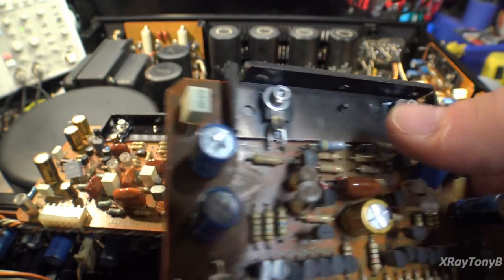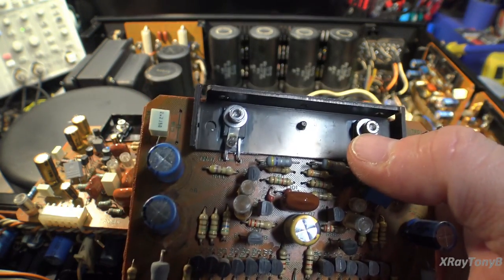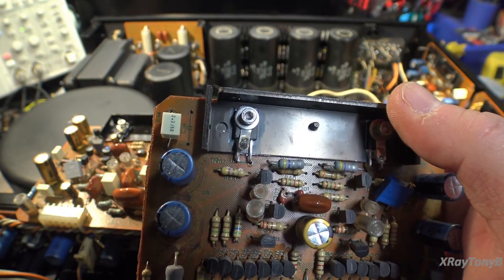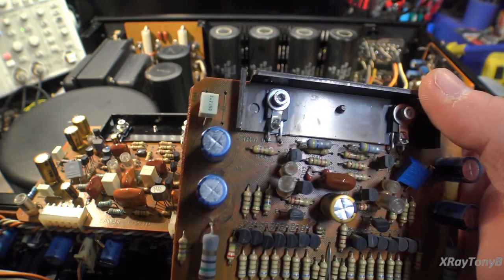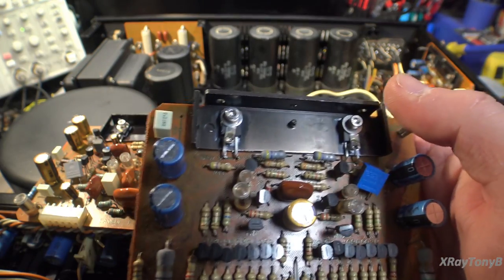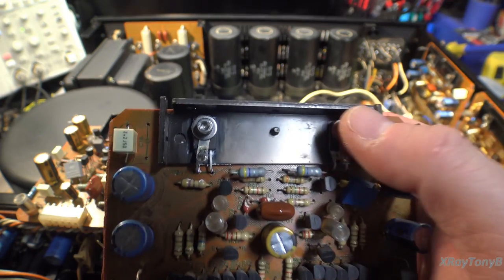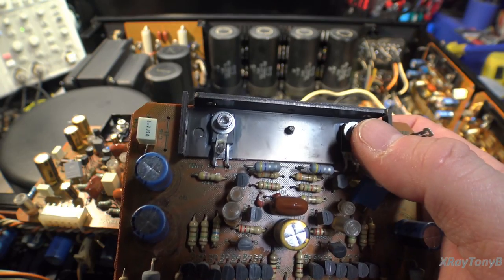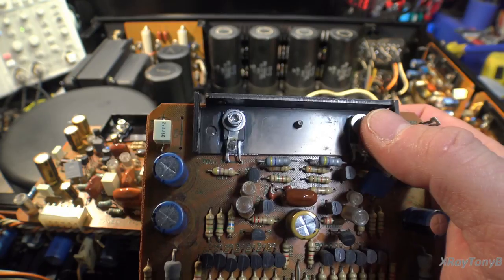The original transistors — I cleaned them up and put them back in, they did work perfectly, but I noticed that with temperature they had a lot of change in their properties as they warmed up. This was with all four modules — all eight transistors were like that. So I ended up taking the plunge and replacing them. It really wasn't that big of a deal. The only problem was finding a modern replacement.